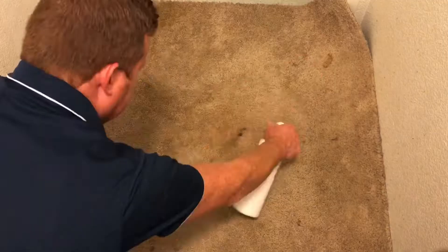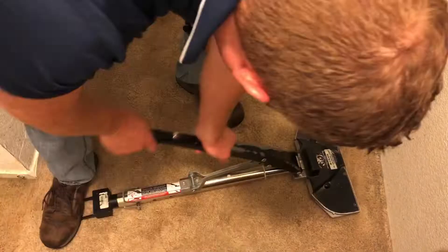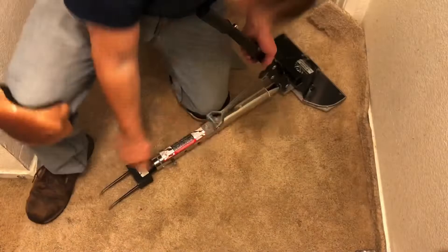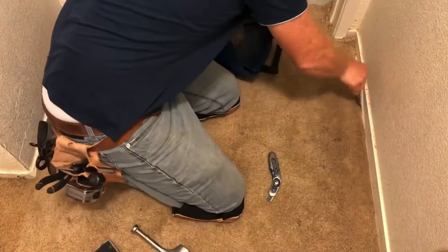This carpet from the closet still has some stains in it. I wish it were better, but this is all we have to work with. Seaming this with our induction seam iron, making sure everything's tight, and doing some spot treatment cleaning. I definitely recommended a great carpet cleaner in San Jose for this customer, who's going to come in afterwards and really do a number on the rest of the carpet. Stretching this back in place, putting it back on those tack strip pins, cutting the excess, and tucking it back in nicely. Making sure everything looks nice and clean and the seams are done well.